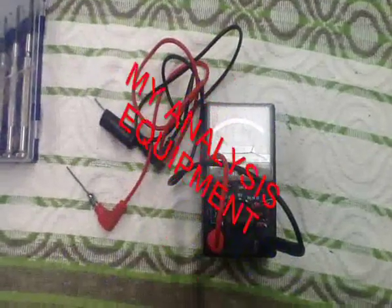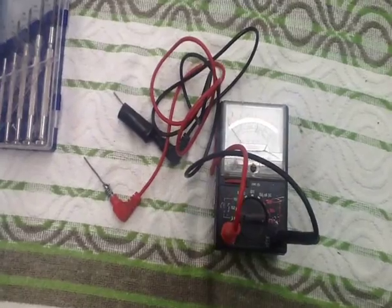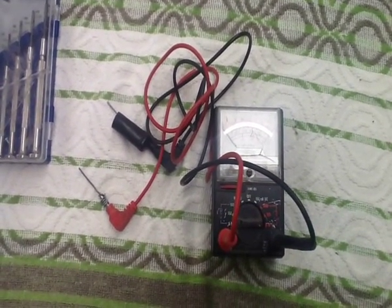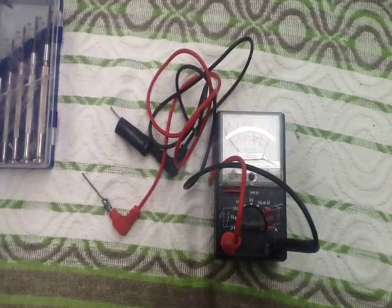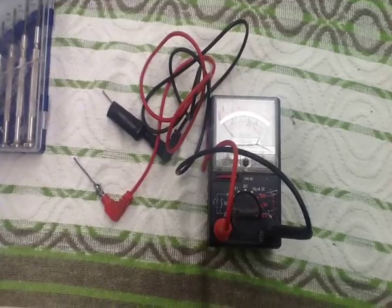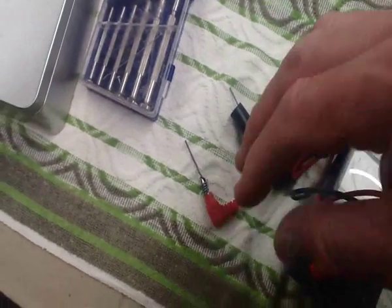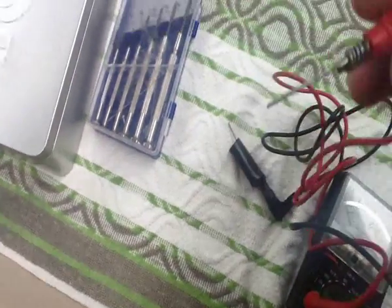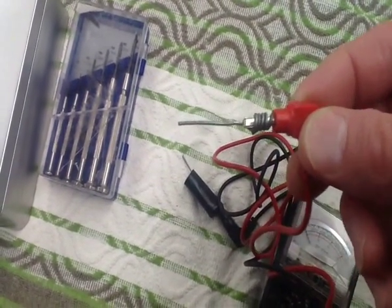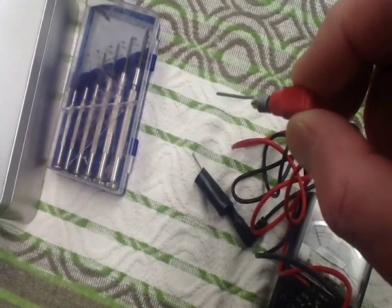To determine what steps need to be taken to fit your emulator, should the information given on the KN5000 video not apply, you can see here that I've used an old multi-tester set on the 15V setting. I have modified this end with a bit of tyre wire that I've wrapped around so that I can poke it in between the little slots in the plugs.